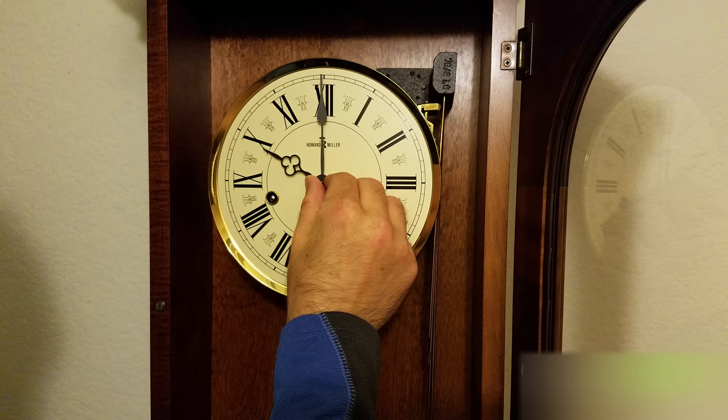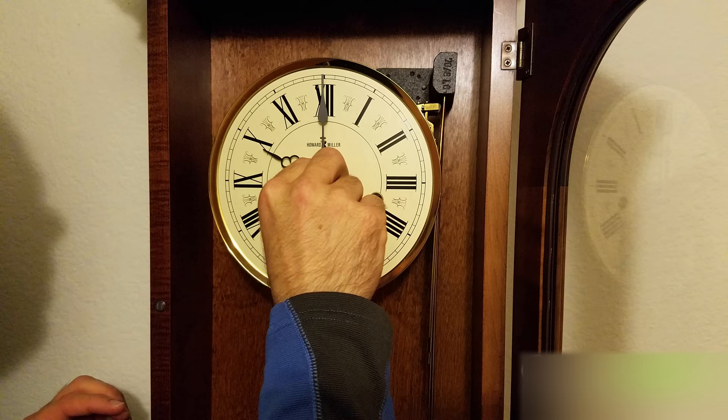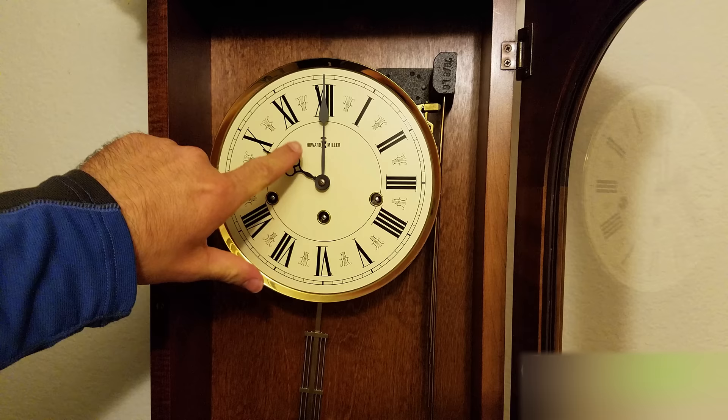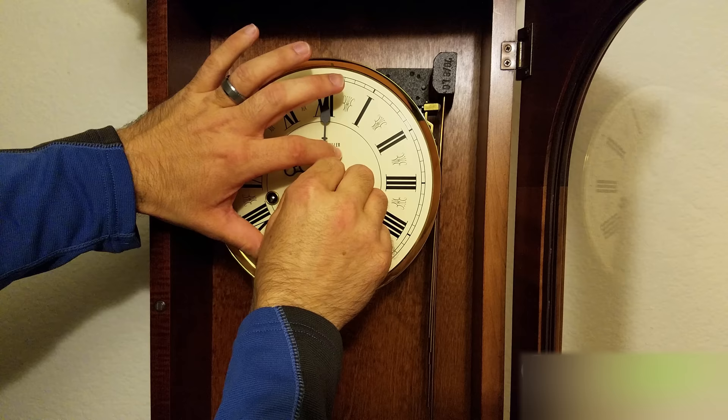Look at that — that's pretty darn close. So that's how you fix it. Be careful that you don't accidentally snap your hand off when you're using those pliers. Tighten it up, and that's it — that's how you fix your clock when it's not striking on the dot. If you do happen to break the hand, you can go into Google and type in grandfather clock parts or clock parts, and there are a couple of really cool sites that sell these exact hands for around five or six bucks. It's good to learn how to adjust your own clock because this is sort of a dying trade. If you get stuck or have any questions, post below. Until next time.